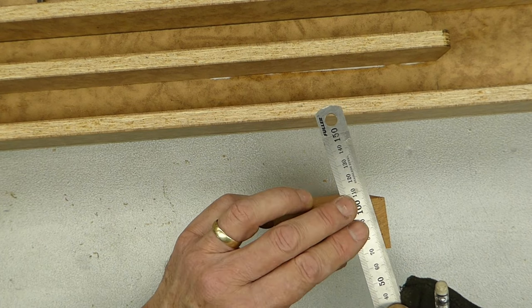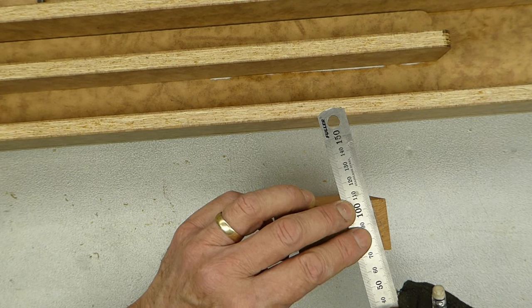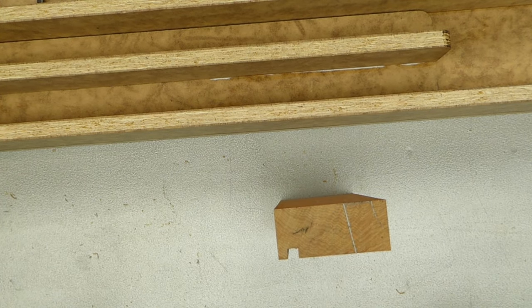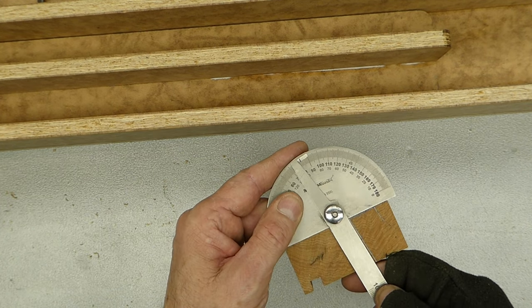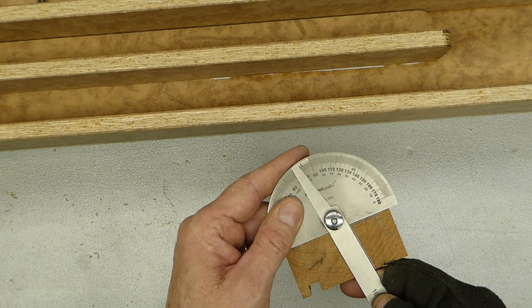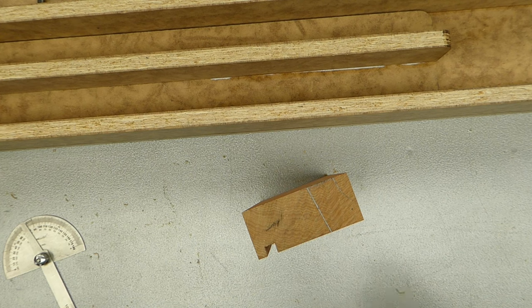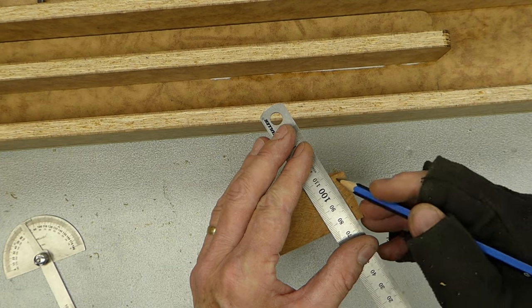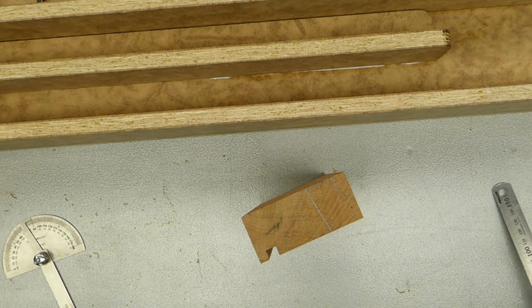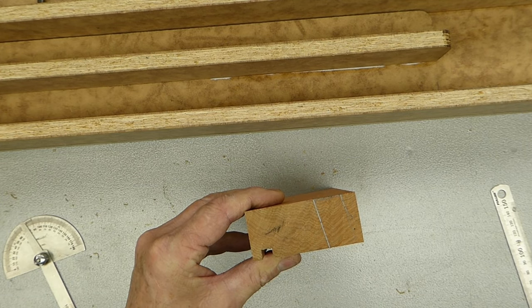I'm not going to cut that curve. I'm just going to create that angle from the other side across here. Let's see what that angle is — nine degrees. I'm going to set my table saw to nine degrees and I'll cut that at nine degrees on both sides, which will create that piece that slots nicely down into that aluminium recess. So let's go.